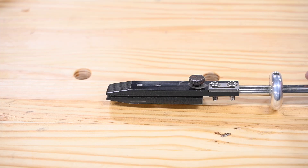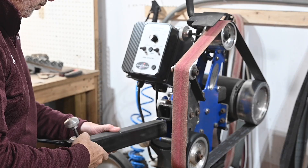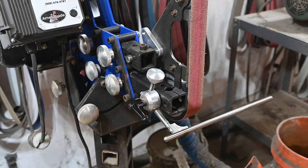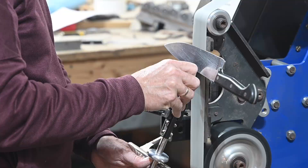First, the clamping system. The clamp has a beveled tip so you won't mess up the clamp if you grind a steep angle into your edge. Then there's a rod with a little guide and handle — you can move this guide up and down with a set screw. The tool rest is mounted on a two inch square arm compatible with all Ameribrade grinders, but they also make a one and a half inch arm for other grinder brands. The arm has an adjustable tool rest that can be reversed, rotated, moved in and out, and articulated in various ways. The tool rest supports the clamp rod so you can scrub the blade back and forth on your belt, flipping it over to grind both sides.